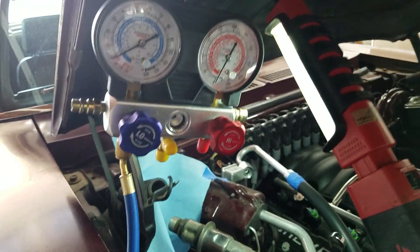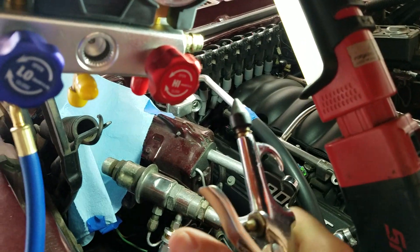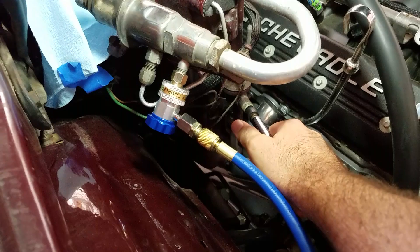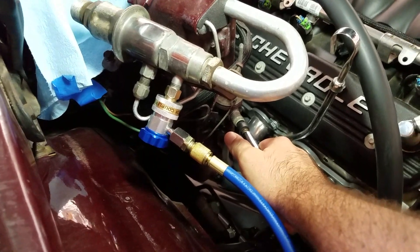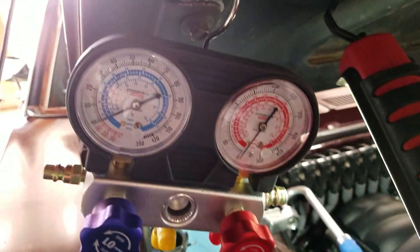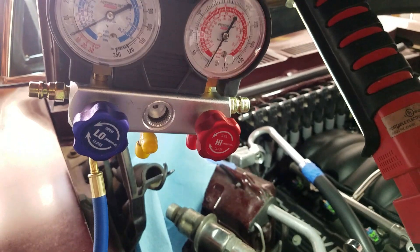What I'm going to do is put some compressed air with this nozzle into the evaporator. This is the inlet of the evaporator at the thermostatic expansion valve, and hopefully this will open up at 30 psi and maintain 30 psi inside the evaporator. So let's see what happens.